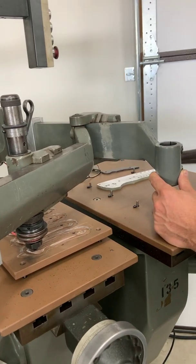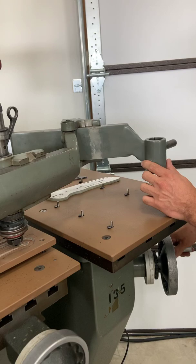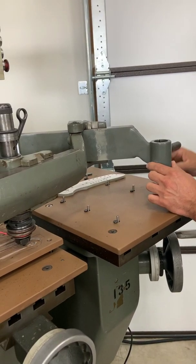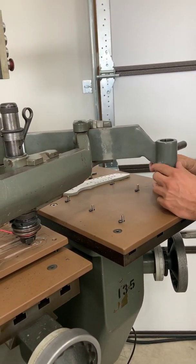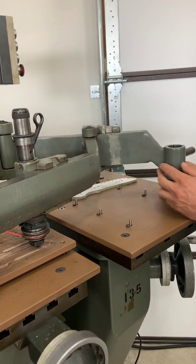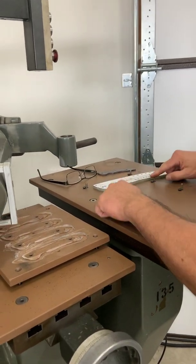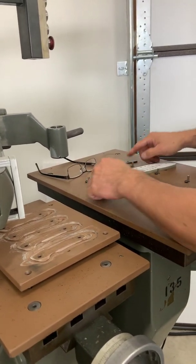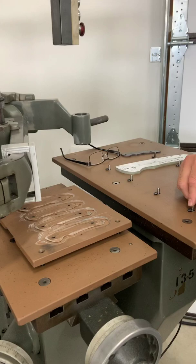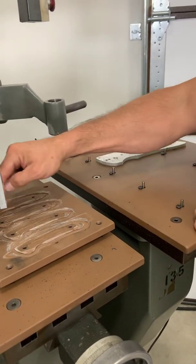Then I will lower this table, move down to the next bushing, bring the table up, bring the stylus into that bushing. It holds it in place because the stylus is connected here. Drill this hole, and then I'll do it to every single one of these pins — all these locating holes. What that has done is transfer this hole into the right position on this plate.